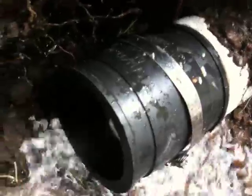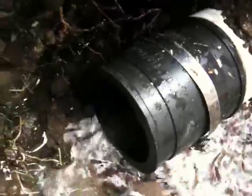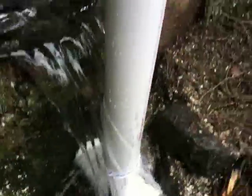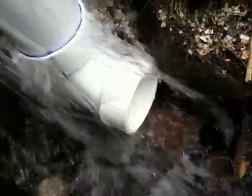I'm running a generator and I've got myself a little sawzall here. I'm going to finish this job up and go turn the power off. I've decided to use a rubber connector clamp union here, because the cut end wasn't too good — there's water, and it'd be hard to actually glue it in this wet environment. And there's no pressure up at this end anyway, so any leakage I get is no big deal. I've got the new stand pipe in place here, and that allows air in when I drain it. So all I've got to do is put a piece of pipe in there. I'll do a dry fit on that one too, because I don't care whether it leaks just a little bit — which I doubt it will anyway. And that'll do it.